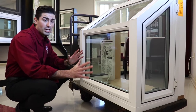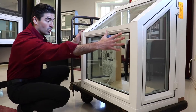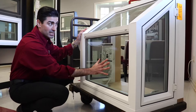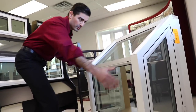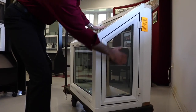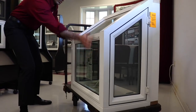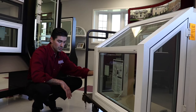So we can see the front here of the garden window. The frame makeup is pretty simple — you have a vinyl-clad wooden birch frame, fused welded on the sides here, a sheet of glass in the front, a sheet of glass on top, and then you have two operable panels on either side. This panel will be able to swing out. This window is non-operable, this is non-operable, and then this side will operate and swing out as well.